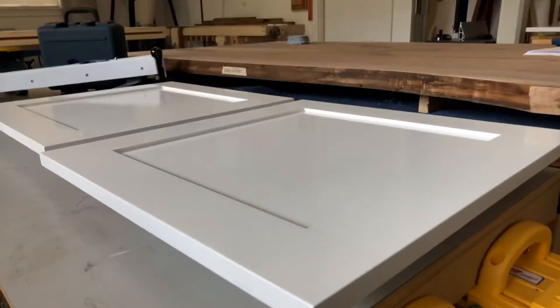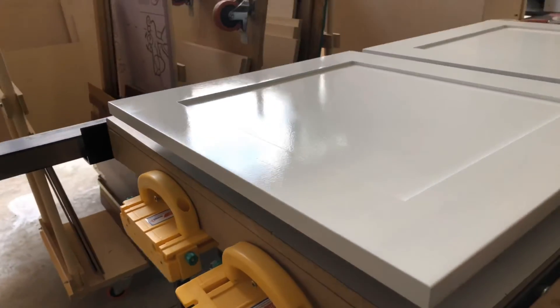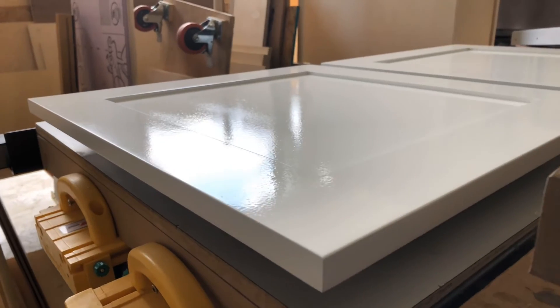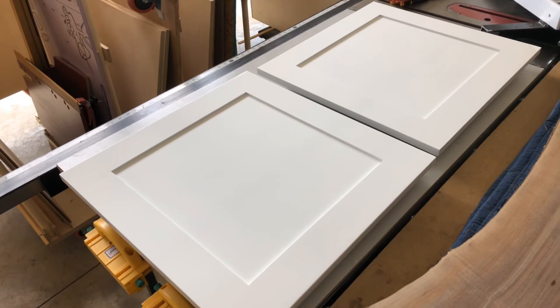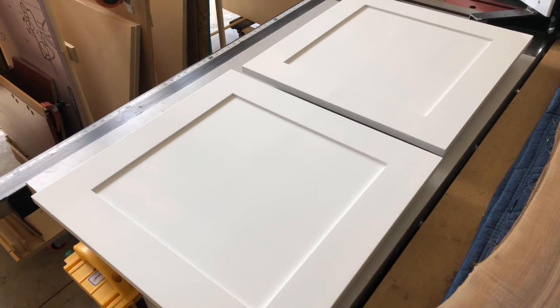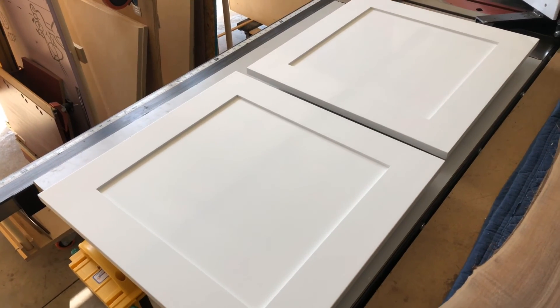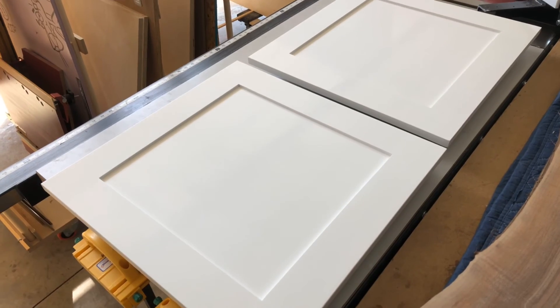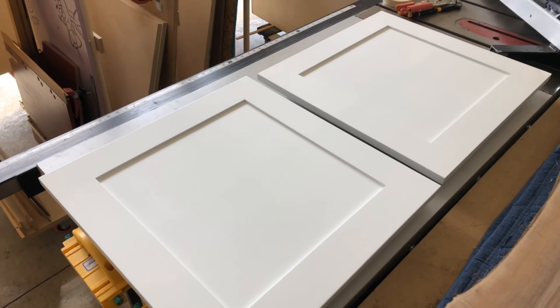Let's take a look at these pieces here — they're all painted up. Laying nice. First coat's on them. I'll hit the second coat tomorrow, let these dry, sand them — probably 240, or somewhere between 220 and 240 — just to scuff them up and give the final coat something to stick to. But that's it. All painted and done. Just gonna close down the machine.